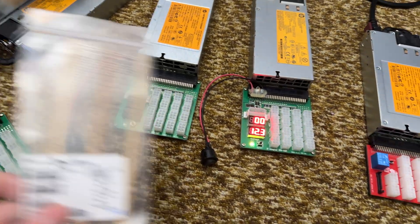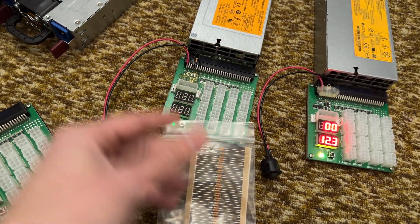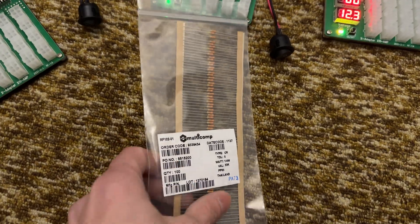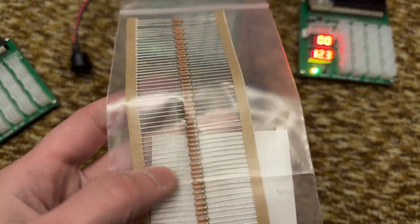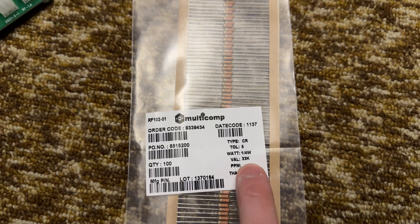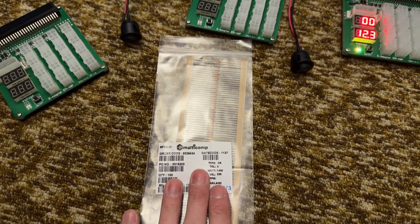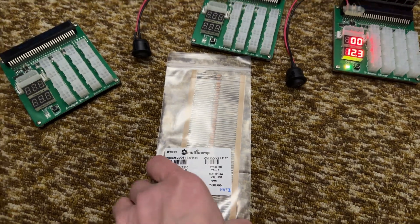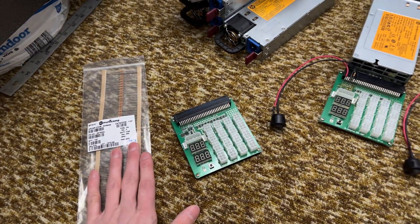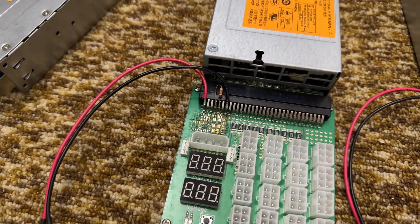That would be my recommended approach. For the hardware, pretty much any two-lead normally open switch will work fine. Ones with wires are nice because they're easier to tack on. For resistors, a typical axial lead quarter watt is fine — these are the most common type people think of. 22 kilohms is the recommended value; anywhere from around 15 to 50 kilohms will work fine. I'll link 22 kilohm packs in the description — they're pretty cheap, a few dollars, and come in packs of 100 and up. Cheap to modify a bunch of these to suit your needs.